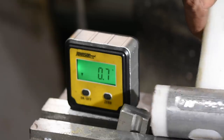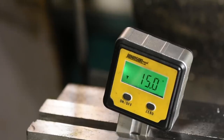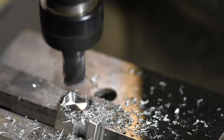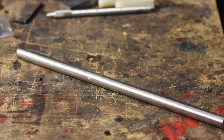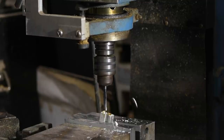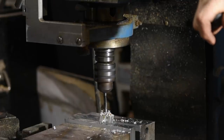Now I'm setting up to drill a hole for the handle to thread into. The handle will be set at 15 degrees. If you don't have it set at an angle, there's no room to get your fingers underneath it and you'll be scraping along on the sword the whole time. I'll be drilling with a quarter-inch drill in preparation for tapping 5/16-18 threads. Before I do that, I'll mill a little half-inch pocket. That kills two birds with one stone — first, the drill will have a flat surface to drill into, and second, the handle shank will seat nice and tight to the tool body by having a flat to engage. I'm being precise here with end mills, but again, you could just as easily drill these using much less complicated tools and they'd still work just fine.